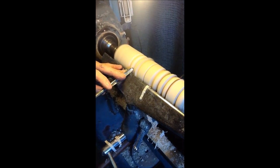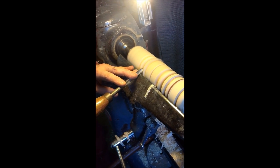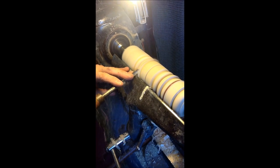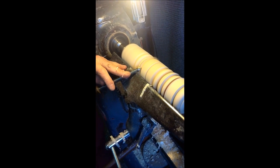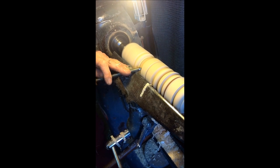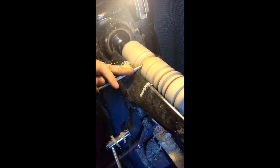Right down to there, see, bring him in nice and tight. How do you bring him in tight? By swinging the handle. Swing the handle round. Then similarly, have the handle swung to start the cove, so you get a nice steep start on the cove. Here again, swing the handle across, you see? And then down into the bottom.